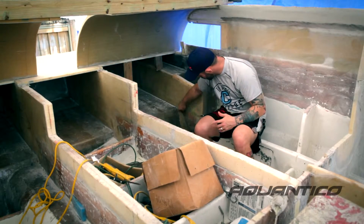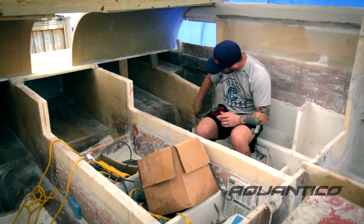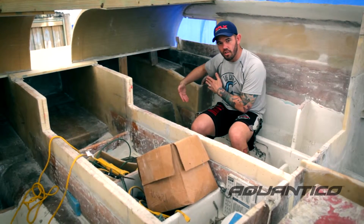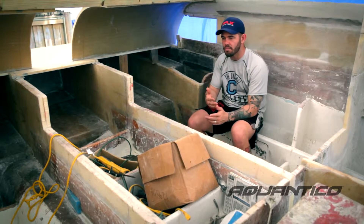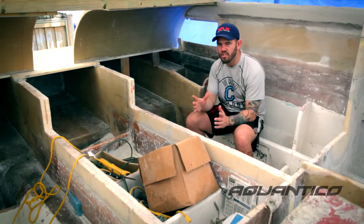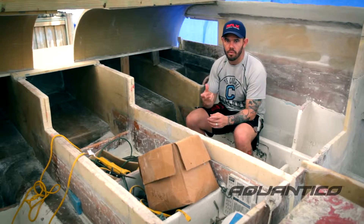Some of the mechanical cuts you can see in the laminate. Here, this angle is cut — the original. We mechanically place the other stringers underneath so that mechanically it can't come loose, and then chemically it can't come loose either. Everything's catalyzed by hand. We don't use spray guns at all, so that there's never a mistake of something being under-catalyzed or over-catalyzed where it becomes very brittle.